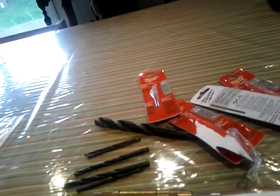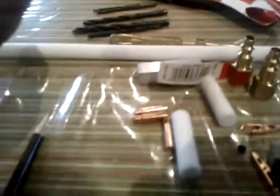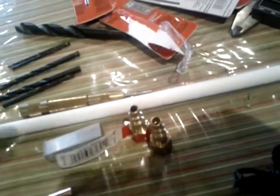It becomes more efficient if you totally wrap the block in several layers of Kapton — by several I mean like six, seven, or eight layers. You'll also need some alligator clips to clip onto the power resistor. The thermistor will be soldered or crimped onto the wire leads so it's not removable, but the heater block you can remove just by removing the clips.